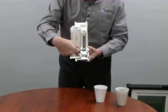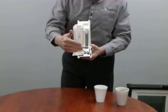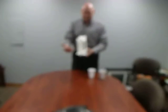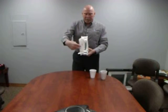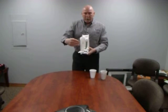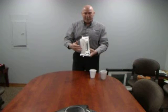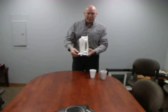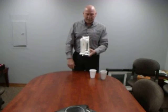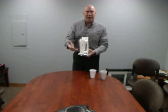When the temperature changes — we'll have zero degrees one day and a hundred degrees another day, so we have a hundred-degree temperature swing — our foam is inserted, and when the vinyl tries to expand and contract, our foam can actually move with that vinyl frame and vinyl sash. It's not adhered to the vinyl, so it's not causing distortion. That's why we feel that inserted foam is definitely the superior way to use foam in your frame and sashes.